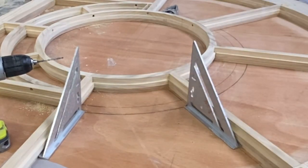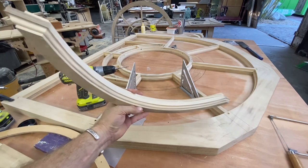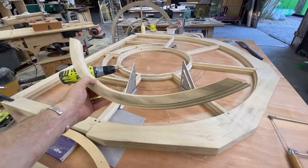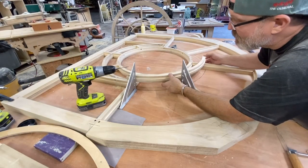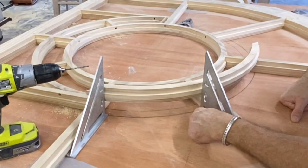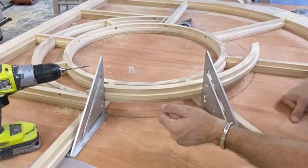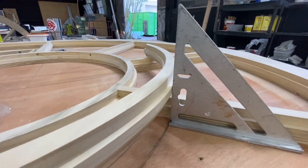Line what up, Mr. Steve? Oh, that's a good question. I've got these curvy muntins that I made already — they're wild. They are wild, but they're running wild, meaning they're long. See how I'm lining that up? I've got my square on my mark, and I put my curved muntin on my square. My square is on the line, and my round piece is touching that.